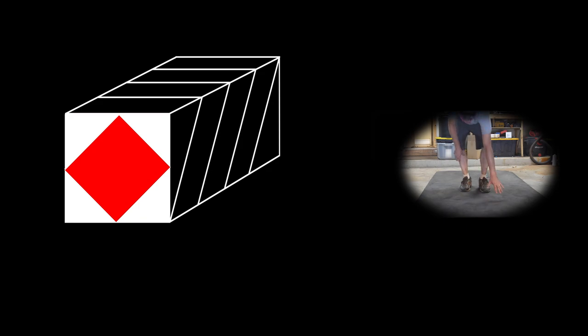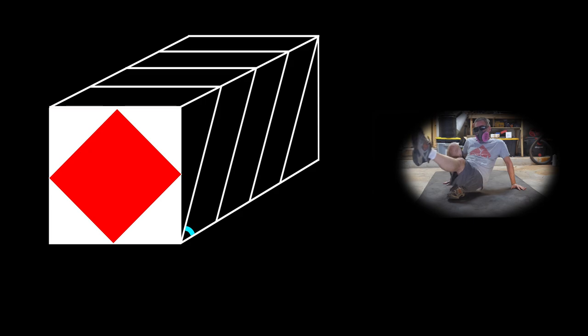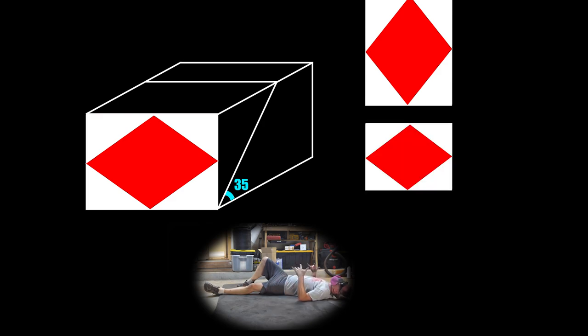To make a square, the purple and the green lines have to be equal. To remain a square after our angled cut, the length of the purple and the blue line will have to be equal. We can't start with a square billet or face — we have to start with one that has been compressed into a rectangle. So if we want to cut a 35-degree angle, the dimensions of our billet have to correspond. If our billet is too tall, our 35-degree angle will yield a tall rectangle instead of a square. If the billet is too short, it will make a rectangle that's wider than tall instead of a square.